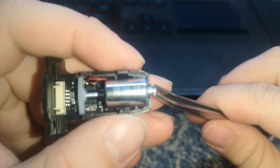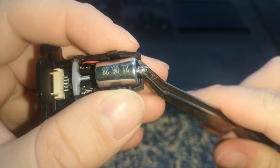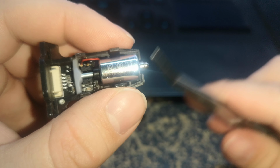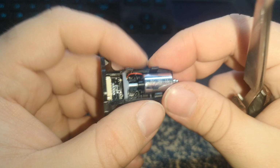Also, that tip has this little design thing, which I quite like. It's visually interesting, but it means that there's a smaller shaft there, so if this thing is canted off a little bit, when it pulls back in, it could get stuck and not home all the way. So you'd want a bit of a chamfer on it.